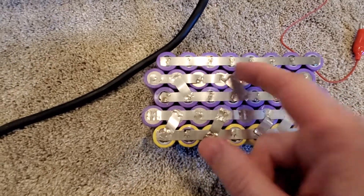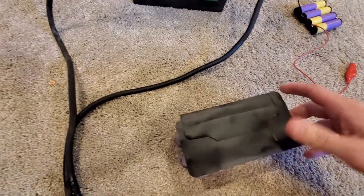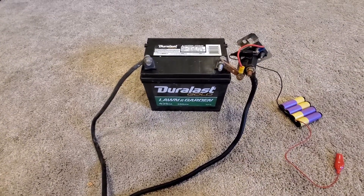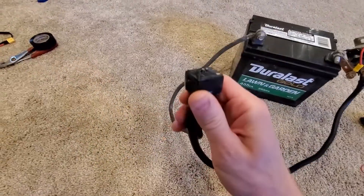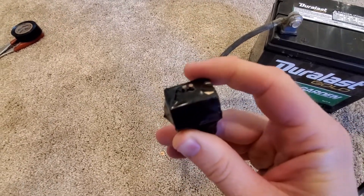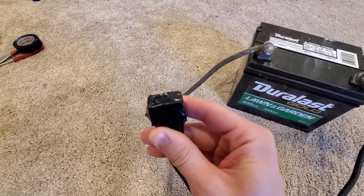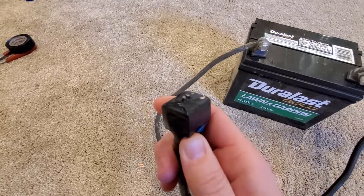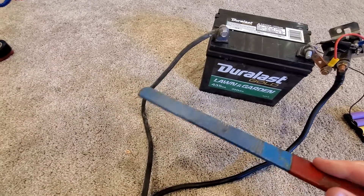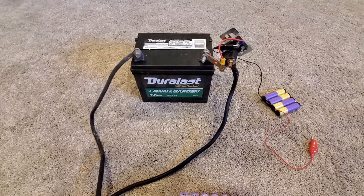You can see they don't come off at all. I try prying up every one afterwards just to make sure that it's nice and solid. But yeah, it's pretty easy — just figuring out how to get this thing hooked up right is kind of the difficult part. This is just some 10 gauge copper wire, the kind of three-phase wire that you would run for a house. That's what I used for the electrodes, and I filed them down so that they are nice and round and clean, and it does the job quite well.